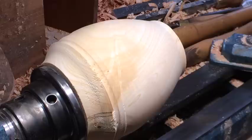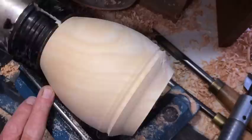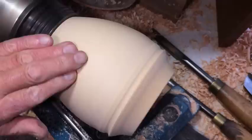Right, so that will now come off and go into some shark jaws. So remounted in the shark jaws here, and as I rotate it by hand, you can see it's very slightly out of whack, which is what's happened is that some of the teeth have just dug in a little bit further into wood than others and just pulled it off, which is fairly common. So what I'm going to do is true up this lot.